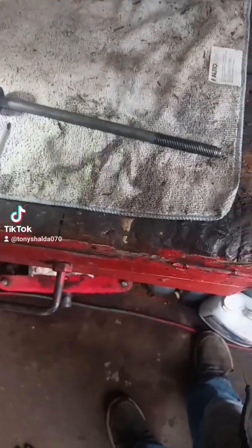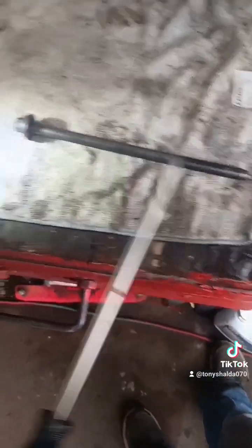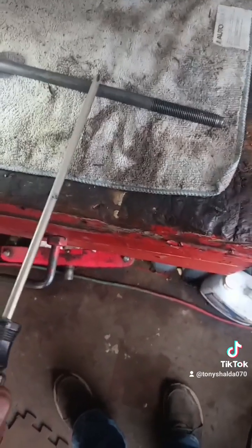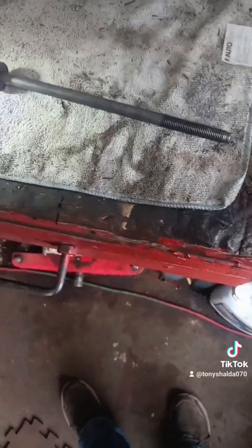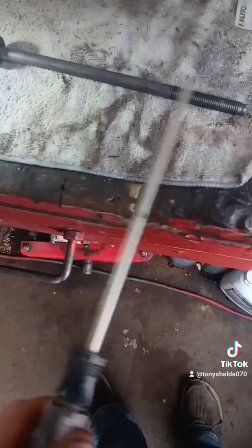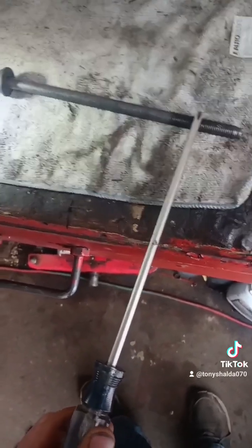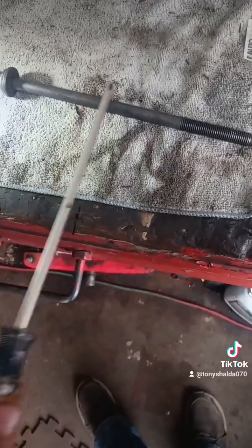So how do we measure clamping force? One thing we can do is make all bolts the same length with the same number of threads, so we have to turn them the same number of times to get the head of the bolt tight to the clamping surface. Then if you make the middle of the bolt weaker — say it takes 500 pounds to stretch that metal — we can tighten everything up, and even if we overshoot it, it will never put more than 500 pounds on the head of the bolt.